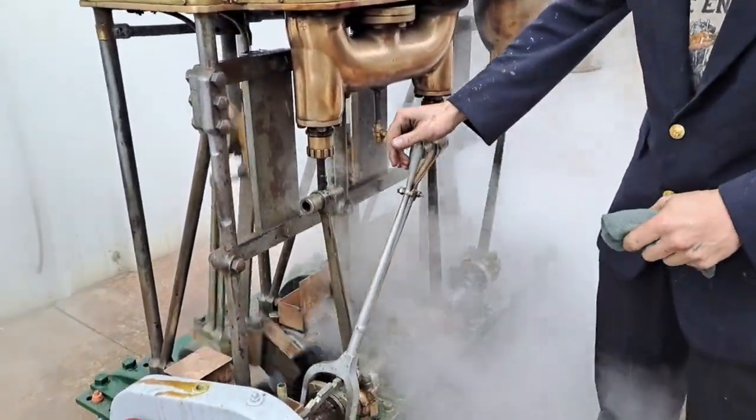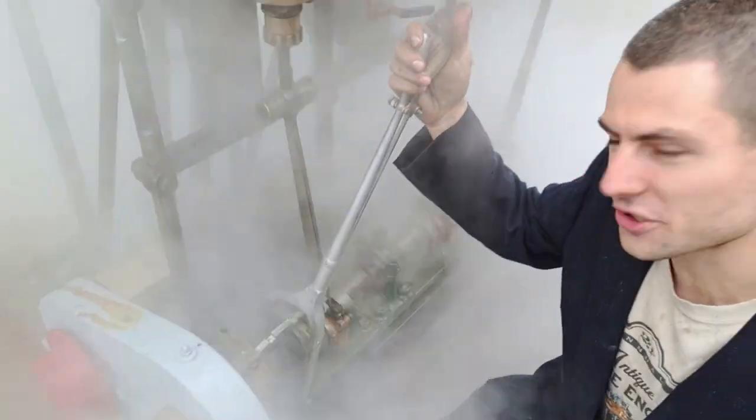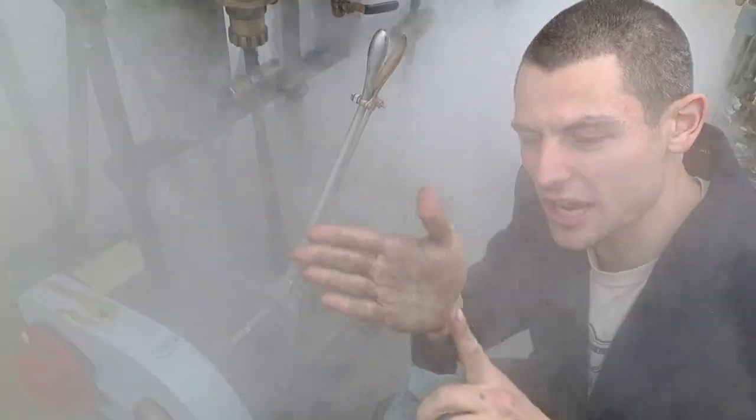The valve gear is one of my favorite things. I love it, but I hate it — because this valve gear affords no cutoff. It does not reduce valve travel; it only changes phase.